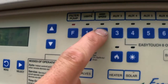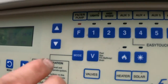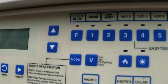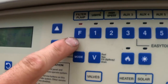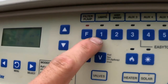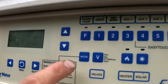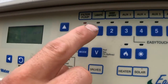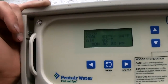We've set a high speed setting on button number two. Your high speed setting could be set on any of the buttons. People use the high speed button to vacuum their pool, drain their pool, or heat their pool faster. Your standard system will have your filter pump, your lights, and a high speed button. Another common thing is a heater button — all that button does is give power to your heater on or off. If you have one, you'll also have to hit that heater button when turning on your heater.